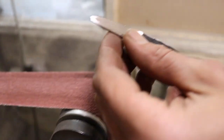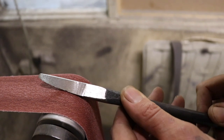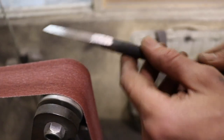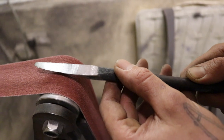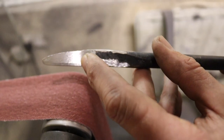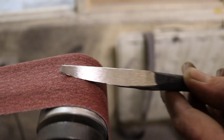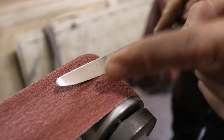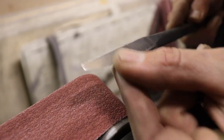So what you can pay attention to when you grind the bevel, because for beginners it's hard to find the right angle when grinding this. What I always do, and right now it's more automatic because I kind of feel where the point is, is when I grind the bevel, I bring it more onto this edge, not completely onto this side, and then let it fall down and move along the surface all the way along. At this stage you can also see when a burr flips over a little bit, and that's the sign: okay, I'm actually reaching the bevel and it's getting sharp.